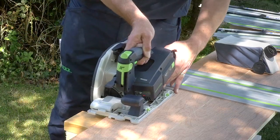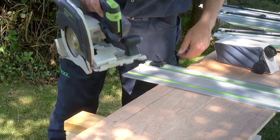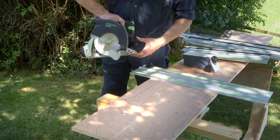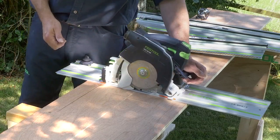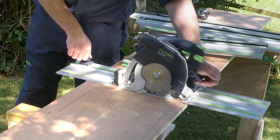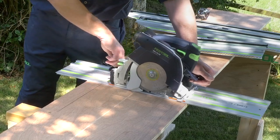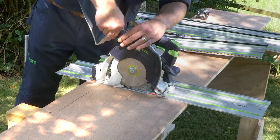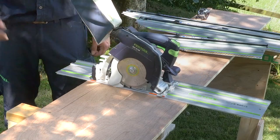The next stage is to hold the saw onto a firm surface. There's a small tab here — we can push down on here and the saw can be in the raised position. I've already marked out where I need to make the cut, so now the pendulum cover can be brought back. We can put this onto the FS guide rail, and of course we want to make sure we work without any risk of kickback. I can use the anti-kickback stop that fits onto the FS rail — bring this forward into position and lock it off. I can mark out exactly where I need to make the cut, and now once the dust bag is on, we can make the cut in exactly the correct position with confidence that it's going to be accurate and straight because we're working with the guide rail system.